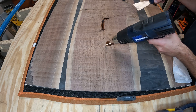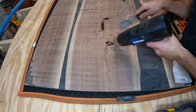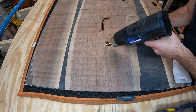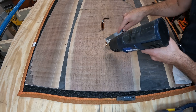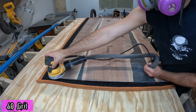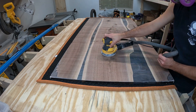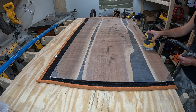Really liking that idea — picked one up, only about ten or fifteen bucks. Haven't tried it yet but will in one of the next videos, hopefully to make things a little safer and smoother. I didn't capture the video of it, but I had to go back and do a little touch-up with epoxy fills to fill a couple of gaps that opened up, especially on the bottom side. Chipped away the excess with a tool, leveled it, applied a little heat with the heat gun, and then it was on to sanding.